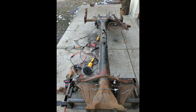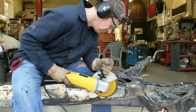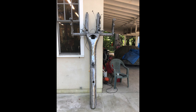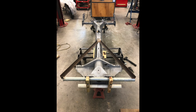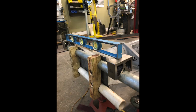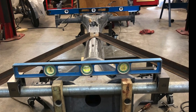The floor pans and the frame head — that bit towards the bottom of the picture — are completely rusted out. It looks like it's been at the bottom of Lake Michigan or something. Someone's actually done this job before on this car. After a lot of grinding and cleaning up it's looking nice and pretty. I made a jig before cutting off the old frame head to capture all the angles for when I weld the new one back on. I triangulated off the tunnel and also captured the caster angle, because I wanted to make sure to reproduce that — it determines the steering feel. I'm leveling it and squaring it to the rear suspension as well.